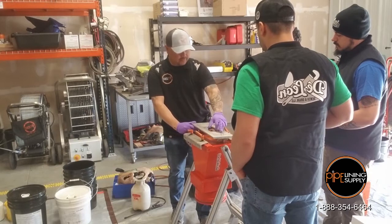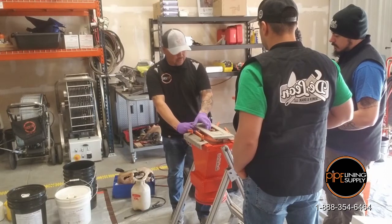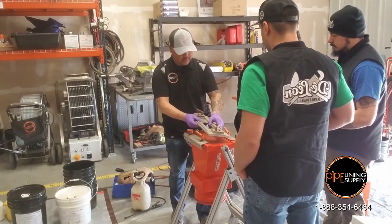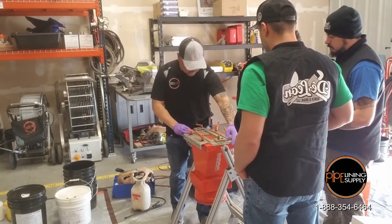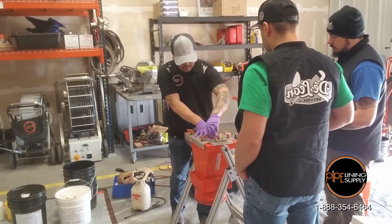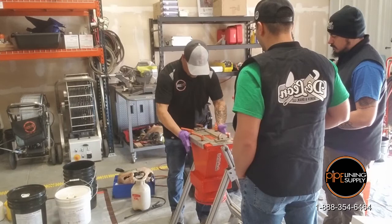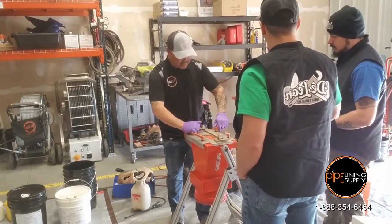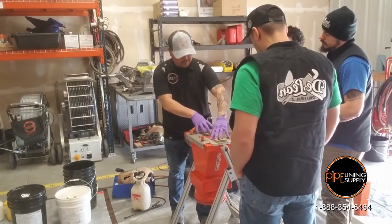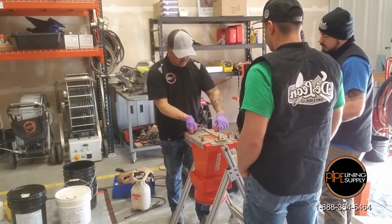So if you're going to shoot that liner, you have to make sure that you put the right plate. It just gets tightened down, and then this is your main cradle plate. When you put this on, I want you guys to be aware — a lot of guys do this — you don't have to over crank this. Just snug. You just want it snug. Because what happens is when you pressurize this vessel, it's going to flex this. And if you over tighten this, you're going to end up bowing this cradle. So you just need it snug. That's all you got to do.